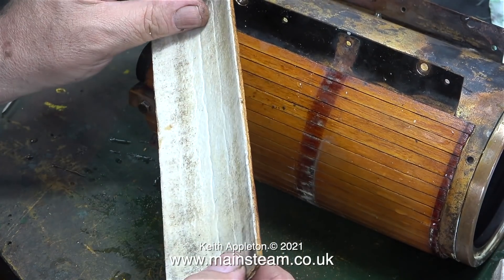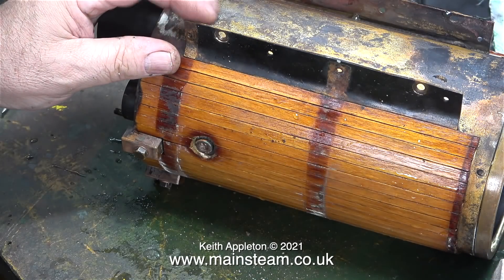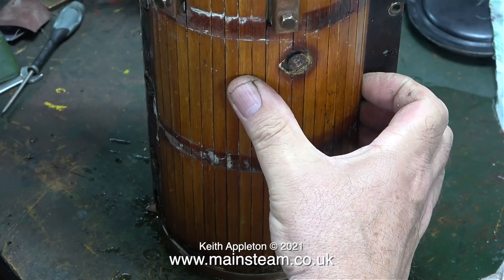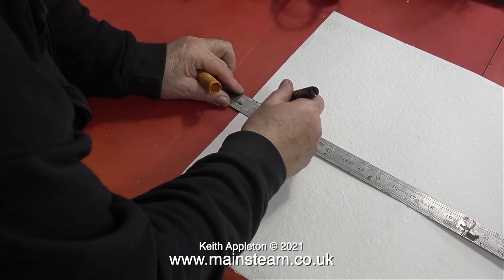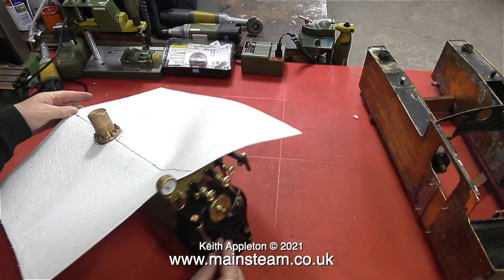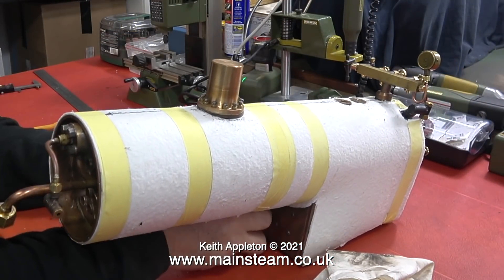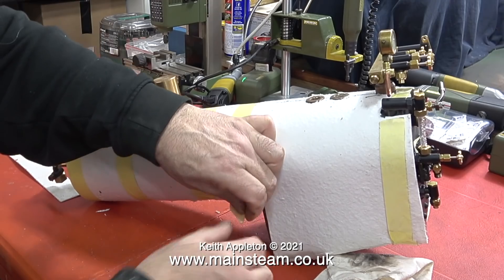This material would appear to be the modern substitute for asbestos — it's made from a ceramic material. I know this because I use this ceramic material frequently on most of my boilers. Also, this material doesn't look, taste or smell anything like asbestos. I don't intend to re-use this cladding because it's past its sell-by date and a bit marked. Instead I'm going to re-clad the boiler using some quite thick mahogany strips. To be honest, the cladding on a small steam boiler like this is fairly ineffective as heat insulation because of its small physical size. This is an extract from my Simplex Prairie Tank video series showing me using a large sheet of this asbestos substitute for lagging the boiler. It is a bit more functional on a locomotive boiler because the cladding is normally metal, which would get a little bit too hot if it was touching the copper that the boiler is made from.